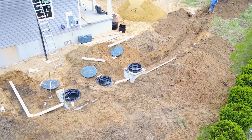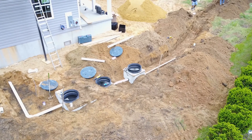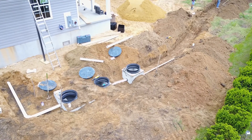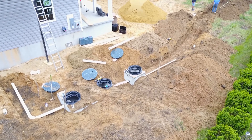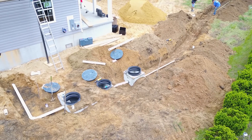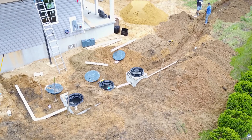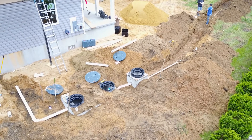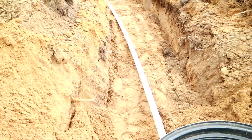Here's an aerial view of how things are laid out so far. We've got the septic tank with the sewer going up to the house, and we've connected it to the lift station. Now we've started running the pressure pipe out of the lift station toward the drain field area. We're going to convert that back into gravity by taking the two-inch pressure pipe, raising it up to the elevation the drain field needs to be set at, and turning it into a four-inch pipe.